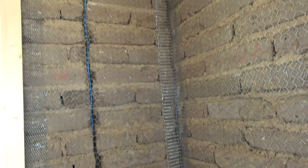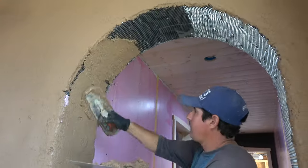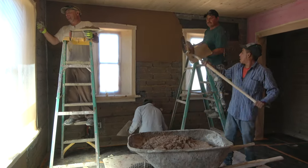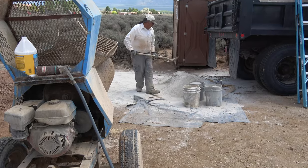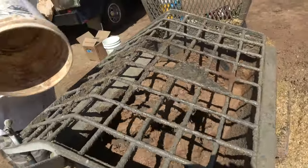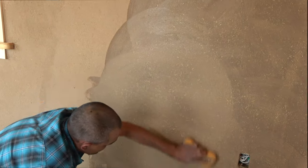Once the plaster crew has finished the first coat on the outside, they jump inside to wire and prep for the interior plaster. On this particular house, the owners chose to use a mud plaster. The mud plaster sticks very well straight onto the adobe, so no felt paper is required. The recipes for mud plaster are highly guarded — we have access to a certain kind of sugar sand that has a lot of mica in it, then you use a lot of straw. After the plaster dries, we go back with a sponge and sponge out all the small cracks, which also acts to polish off the mica and the straw for the final surface.